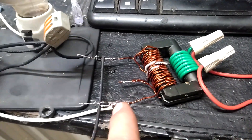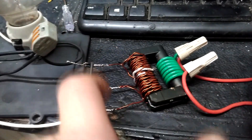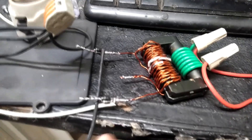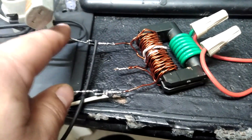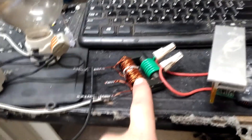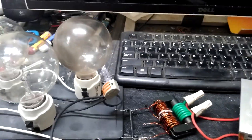If I'm running two bulbs, I'll put one on each side. That's similar to a residential service feed where, if my two loads are identical, I shouldn't see any current across the center tap. In this case it's not quite like that because I've got two diodes coming out. So I'm going to connect these two diodes together as my positive output, and the center tap will be my negative. I'll drive it with a 20-volt drill battery instead of 12 volts and still get roughly the same line output.